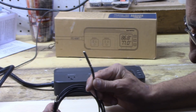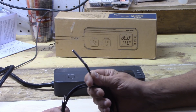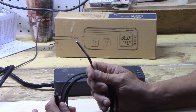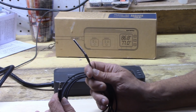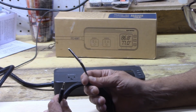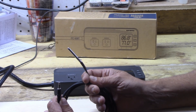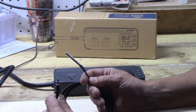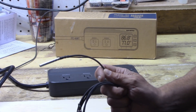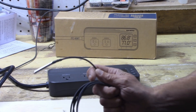This is an R25C — not an RT — so an R25C thermistor used as a temperature probe. The R25 references 25 degrees Celsius as its reference point, and it's an NTC — negative temperature coefficient — as opposed to a positive temperature coefficient. The benefit of the NTC is its accuracy and response. That's why they use those, and they're actually a lot cheaper and easier to replace. You can get one online anywhere.